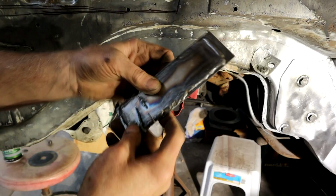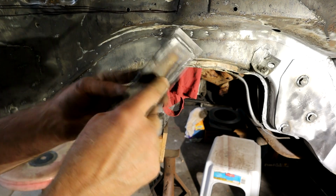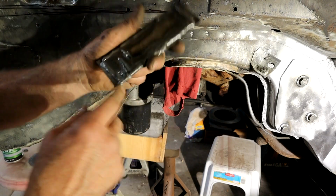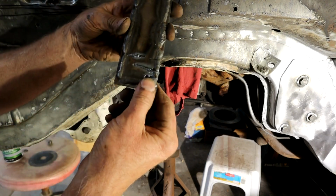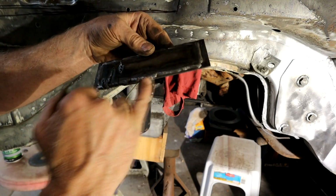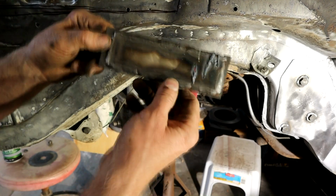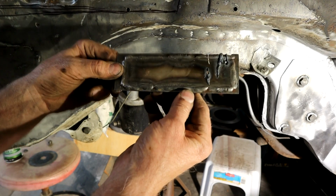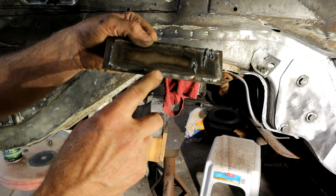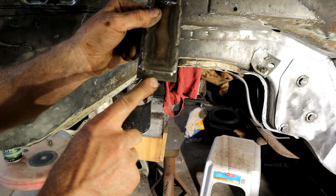Okay, this is one I practiced some time ago. This metal on the top here is 12 gauge welded onto 16 gauge. And I messed up here. I was playing with a plasma cutter here, so ignore that. But you can see I started off here messing around, getting my speed right, and then started to play with the wire feed and temperatures and stuff, concentrating on the top edge of the 12 gauge and allowing the weld to kind of roll into the other metal. So you can see it started to get a lot neater here.